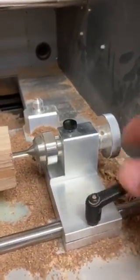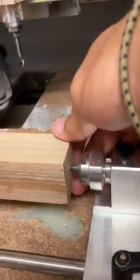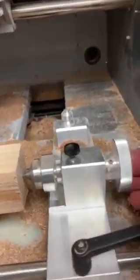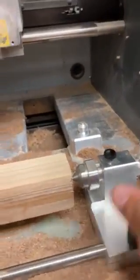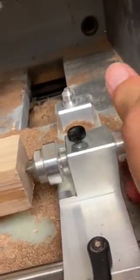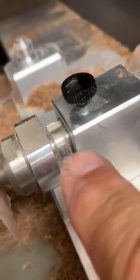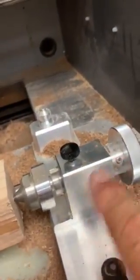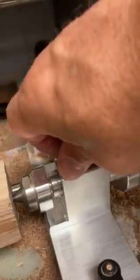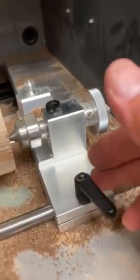Once this is relatively tight, the next piece — this is loose because it's been loosened — we're going to slide this right up against our blank. I drew an X to find the center point over here. Once we've found that, I'm going to push this up snug against our blank and latch it down. So now it's not moving in this direction at all. In addition to that, we want to screw this in right into our blank to really hold it. We've moved this in about a sixteenth of an inch, plunged into our part, so now it's nice and tight. To make sure it doesn't rattle out during cutting, we're going to clamp it down by screwing this down. So this is a three-point locking system.